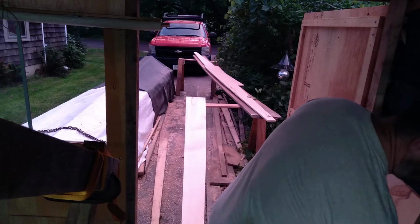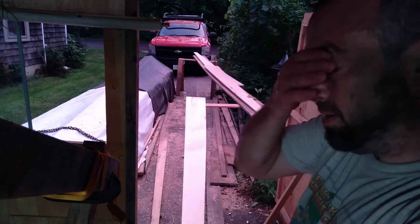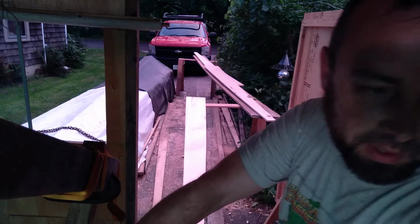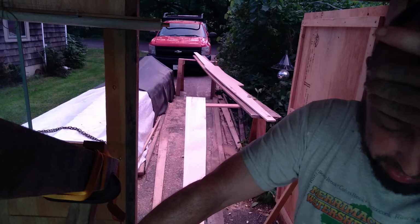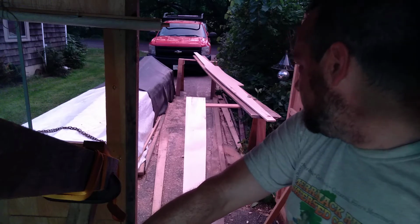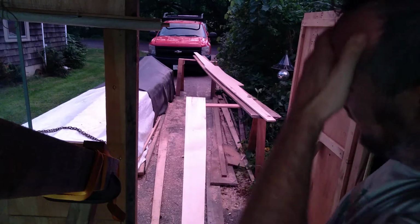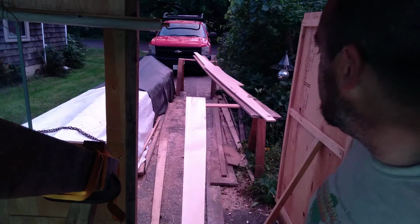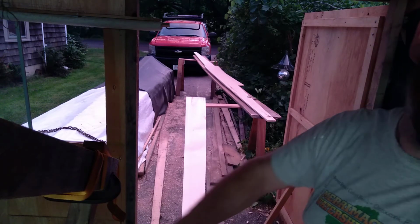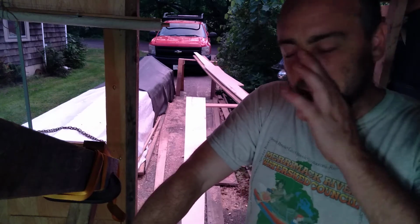So I was just squaring up the edges on this next set of planks. I used the number 2 plank shape, which is the third plank on the boat. It's the one that we nailed on last video. So I used the other plank, the one that's not yet nailed on the boat, to cut out the shape of these planks here that are going to be the next plank up. So the number 3 plank and the first plank at and after the first knuckle.